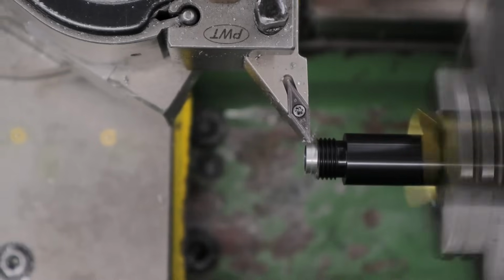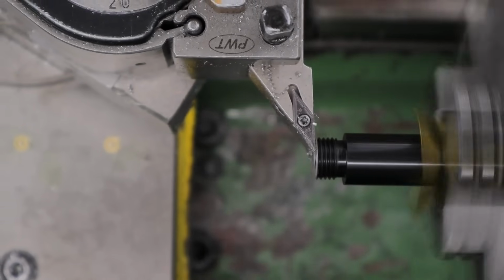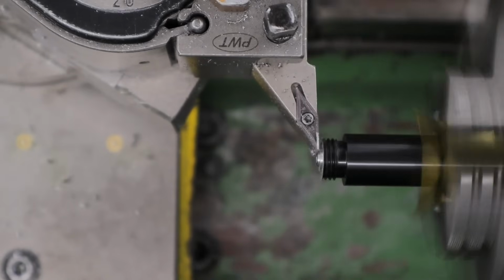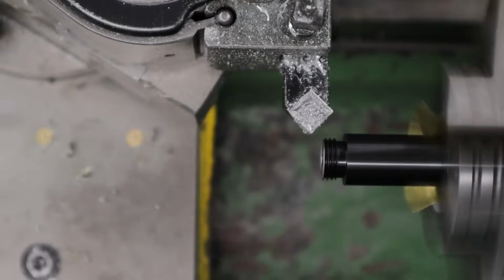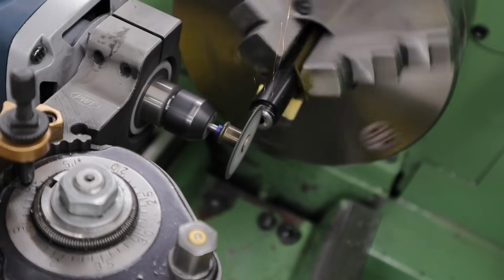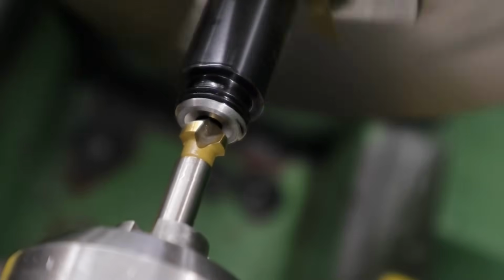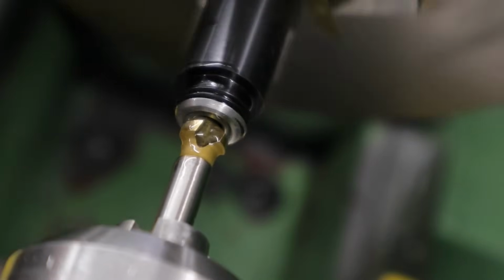With that said, the next thing we'll do is discuss some of the modifications I've made to the rifle. And obviously my first job was to fix the barrel. To do this I concentrated on one end at a time, starting off with the muzzle end, and what I ended up doing was cutting the last 5mm off the end of the barrel and then re-crowning it. This did shorten the 1/2" UNF considerably, but it did not remove the choke. Doing this didn't completely fix the accuracy, although it did make it significantly better.